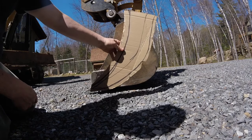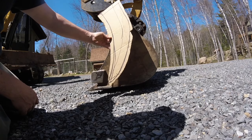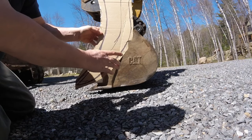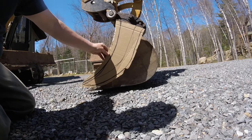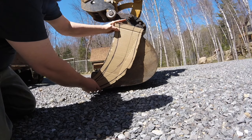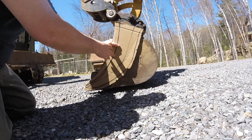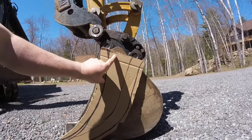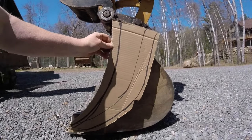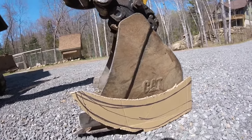The first step of the process, I'm just making a quick template out of cardboard. You can see I drew three or four different curves and angles on there, looked at some pictures on the internet and found the shape that I wanted — what I thought would have enough strength if I went with one-inch steel to have enough width to give it plenty of strength. Looking at the curve, it ended up coming pretty close to the curve on the bucket and almost the same size, so I knew it was approximately 19 inches, but this ends up being just a little over 20. I'll have to trim just a little bit on the top edge to get the right angle I want, but right now I'm fairly close. I'll go with what I have and adjust accordingly with my plates for the pins. That's the first step.